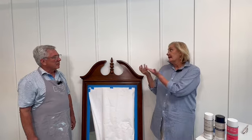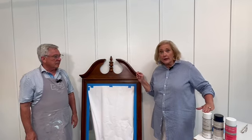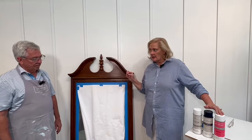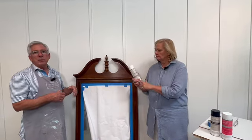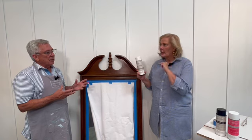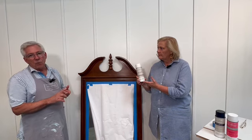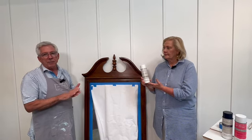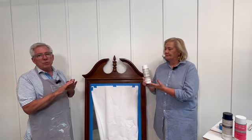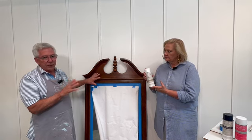A lacquer is normally a three-part process, and Jean is a lacquer expert, so I'm interviewing him on how we need to do this correctly. Normally we have a primer, the color, and then the clear that goes on top. On the primer — so many people think it's for iron or metal, but no, this is actually a sanding sealer, which is a soft lacquer. What that does is, if you've got raw wood, it will seal that raw wood. If you've got a grainy wood, it will fill that grain so that the lacquer will be smooth. The smoother the lacquer, the more shiny it is because of that reflective value.